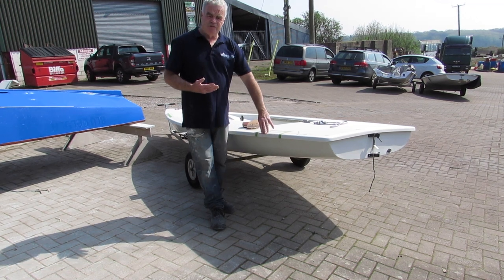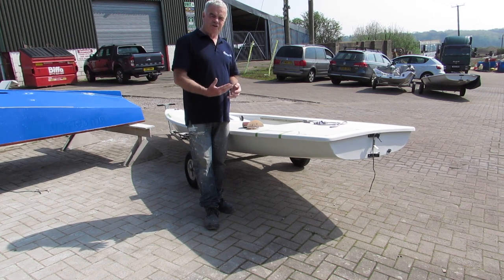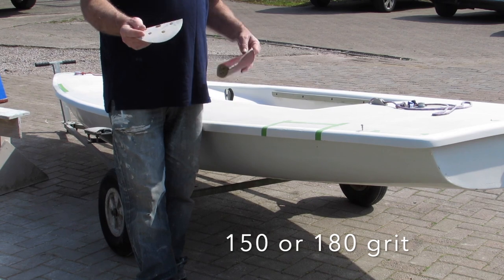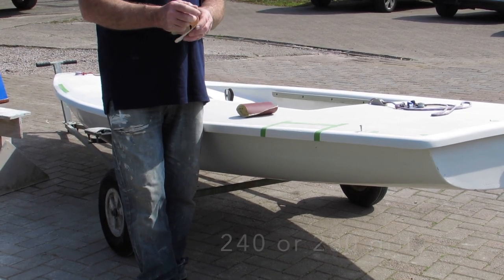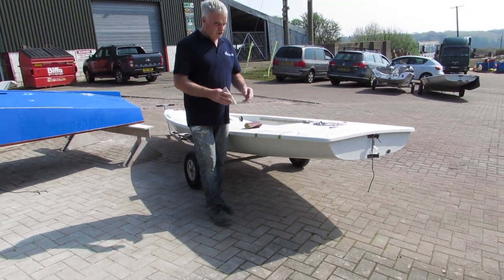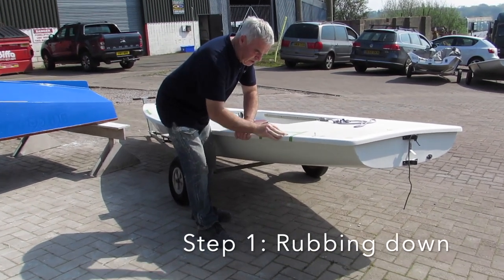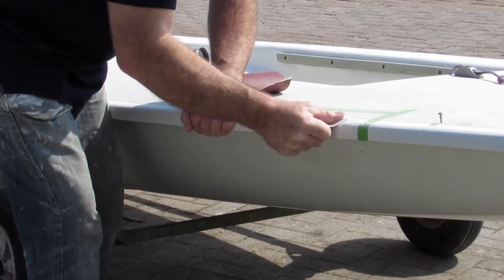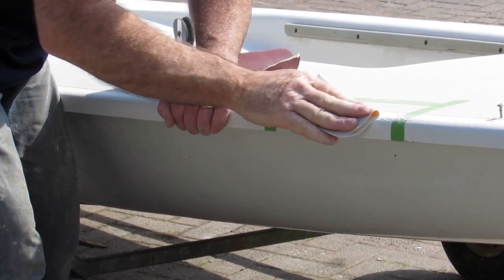What we're going to do now is, with this gone off rock hard, I'm going to sand this down so it gets really flush. We're going to use some quite coarse sandpaper — a combination of 150 and 240 grit sandpapers. These are readily available from hardware stores or online. So I'm just going to start knocking this off. It's quite aggressive and yes, you will cause a lot of other scratches, but we are not expecting to finish the job now. We are going to just get this nice and even and flush.